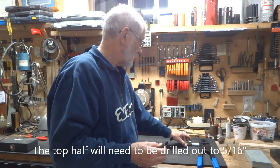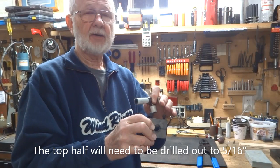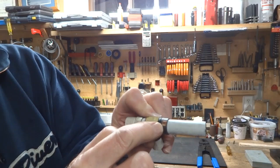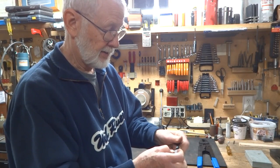After that I decided to try it out on this piece of PEX. I put my crimp ring on, put it in, and tightened up the two bolts, alternating a little bit as I reached the maximum depth of the bolts. You can see here where it's kind of bitten in on this side and that side as it came together.